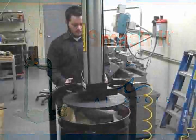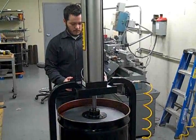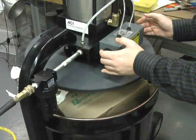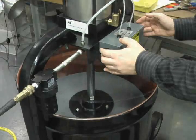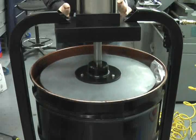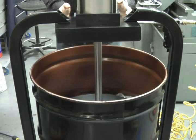Compacting waste with Smash It Compactors is easy, and facilities can save a significant amount of money, time, and space by using these innovative machines. Smash It machines compact waste into 55-gallon drums or cubic yard boxes. Smash It compactors are powered by compressed air and produce up to 3,400 or 5,000 pounds of crushing force, depending on the model.